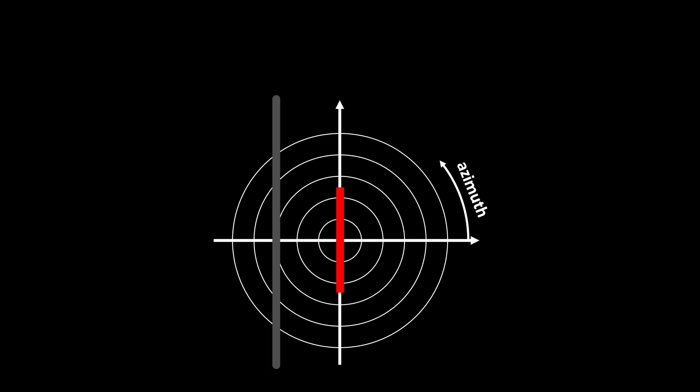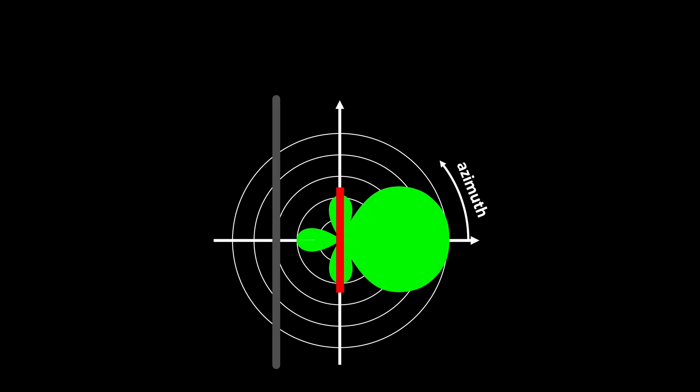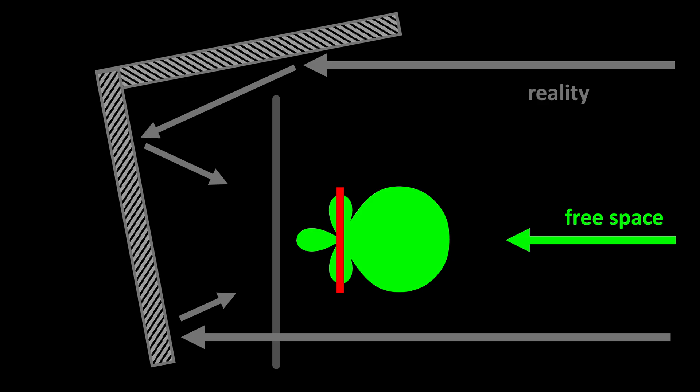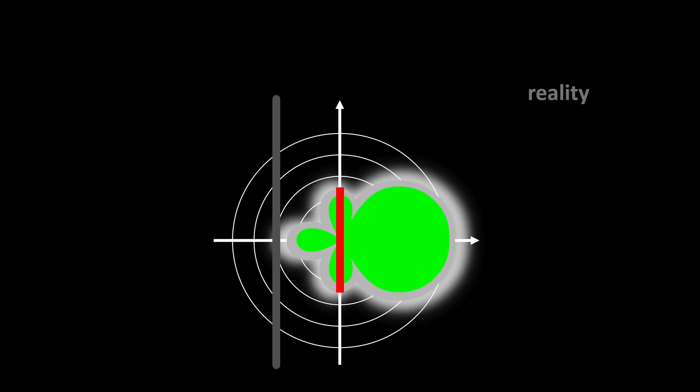Now, I am asking myself the obvious question: could you measure the antenna's radiation pattern this way? The answer is, unfortunately, only to a limited extent. Let's imagine the horizontal radiation diagram. The antenna is not only receiving a signal from the front, but also reflections from all sides. Since the signal from the main lobe is dominant, we would be able to estimate the lobe based on this measurement. However, while rotating the antenna to measure the side lobes, its main lobe picks up reflections, resulting in a kind of blurred directional pattern. Small side lobes and nulls can be hardly measured this way, unless you are measuring in free space or in an anechoic chamber.